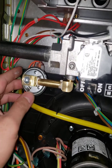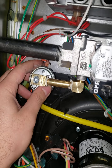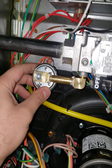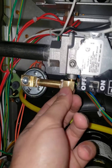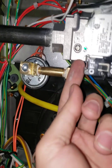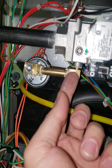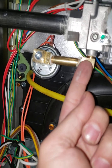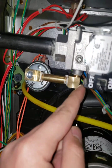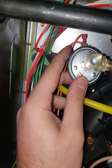The last part is to install this low gas pressure switch — that's what it's technically called. This little brass elbow that comes with it goes underneath where the inlet of the gas pressure is, wherever you want to connect your manometer. This screw used to be here, so we take it out and install this assembly here — and this is the low gas pressure switch.